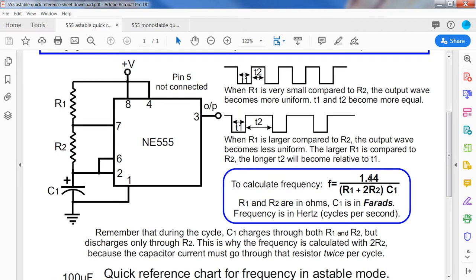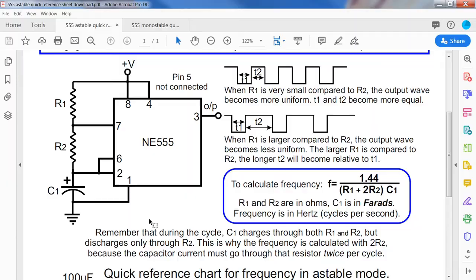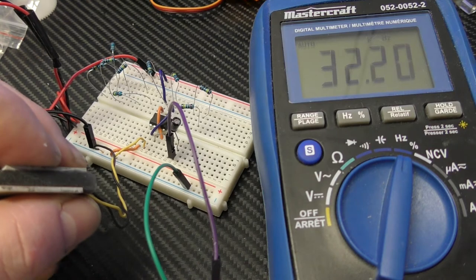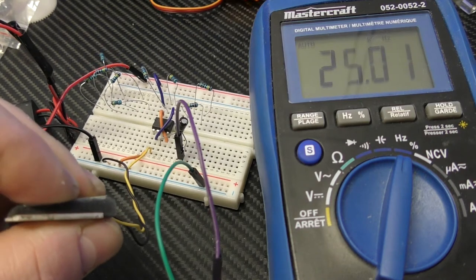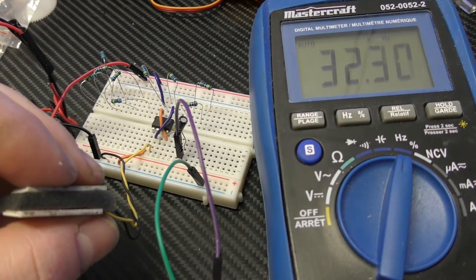Here's the formula for calculating the frequency generated by the incredibly useful 555 timer chip. For my demonstration circuit, the largest resistors I had on hand were 1 megaohm. To get the frequency down to the range of human hearing, I had to daisy chain them so my total resistance for R1 was 6 megaohms and R2 was 3 megaohms. When I just used 1 megaohm resistors for R1 and R2, the frequency of my squishable sensor went from about 32 kHz down to about 24 kHz. So this is beyond the range of human hearing, but the faster frequency is better for what we want to do.